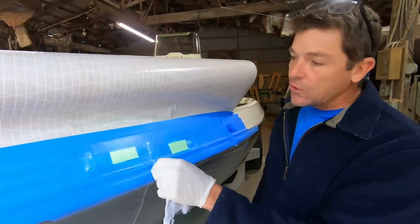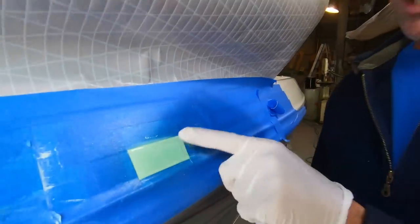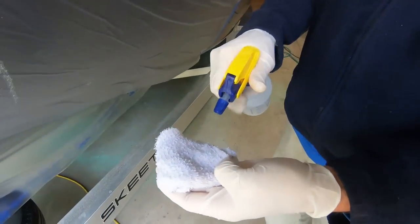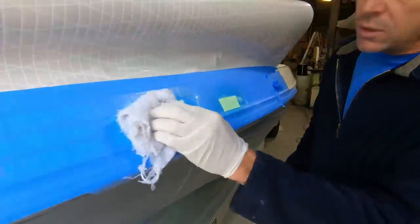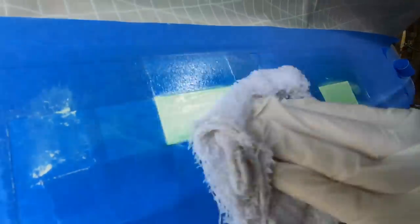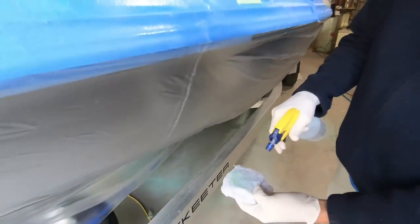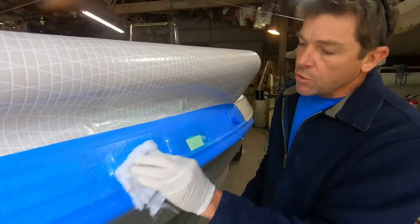It is the next day — we let this cure overnight. You can see the green film that the PVA has dried to the touch and has allowed that gel coat to cure. What's interesting about the PVA is it's just a water-soluble product. Generally you can just take a cloth or a rag and with a little bit of agitation you can see it's come off on the cloth — you can see the green tint. I'll go ahead and just remove that with a cloth and a little bit of water.